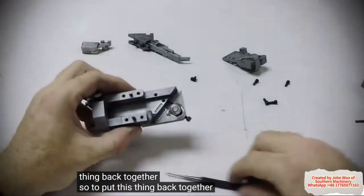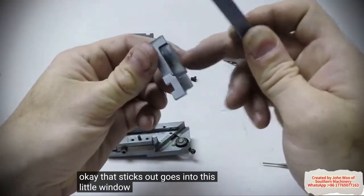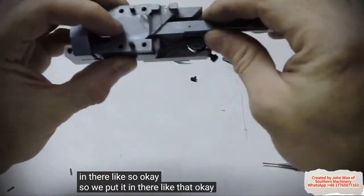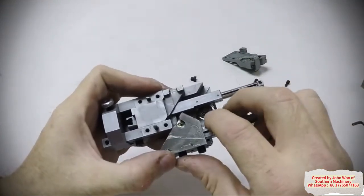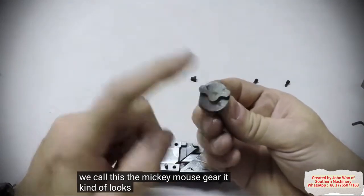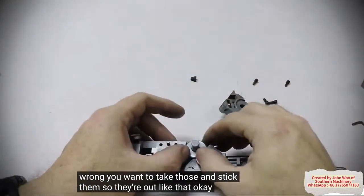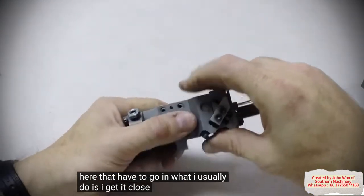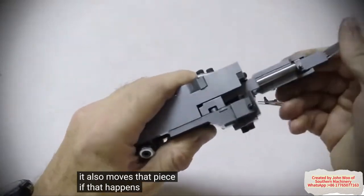So now we just got to put the thing back together as we took it apart. The first thing you want to do is take this piece — this little ear here that sticks out goes into this little window right here, just like that. Once you've got that together, that flips around and fits just like a puzzle, right in there. Next, take your piece and slide the ball bearing set in like so. And the trickiest part is this little thing right here — we call this the Mickey Mouse gear; it kind of looks like one. You want the ears pointing out away from the head. Then you just kind of set it there, flip this around, put it on to that, and there are pin holes right here that have to go in. Get it close and then just kind of tap it. If it worked, what you should see is when you move this, it also moves that piece — then you've got it back together right.